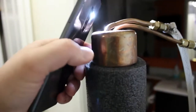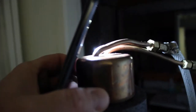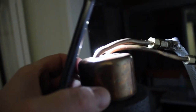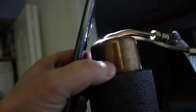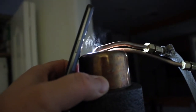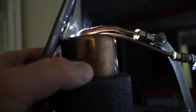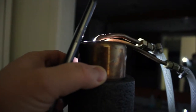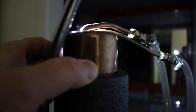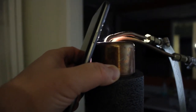In the first stripping run video, we did see little tiny puffs of vapor like you see up on the screen. These little puffs were probably helping stink up the apartment alongside the hot distillate coming off the stripping run. Aside from stinking up the place, the tiny puffs also mean that not all the vapor is being condensed — some is making it past the condenser, meaning we're losing a little tiny bit of distillate, which is not what we want. Optimally, all of the vapor gets turned back into liquid and we get the maximum yield and the least amount of smell.